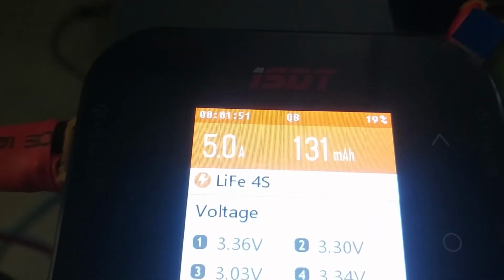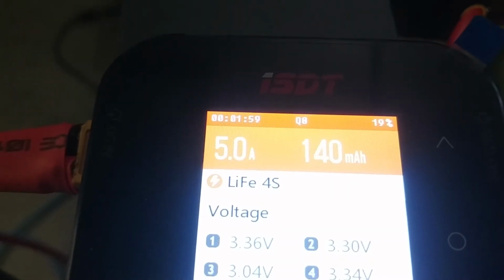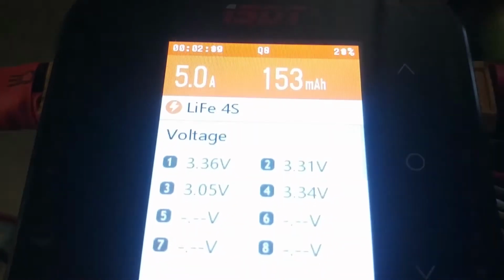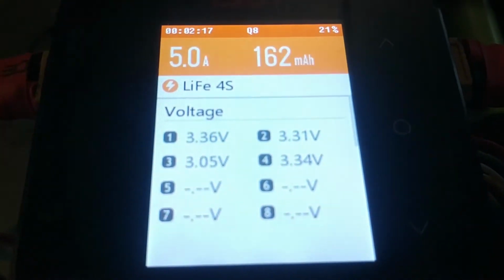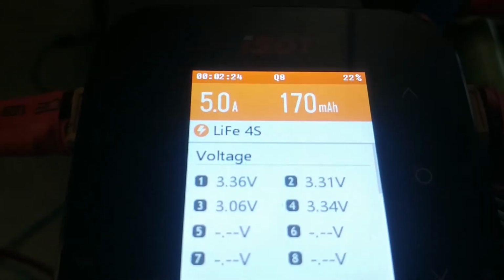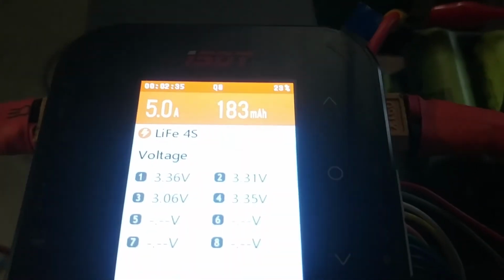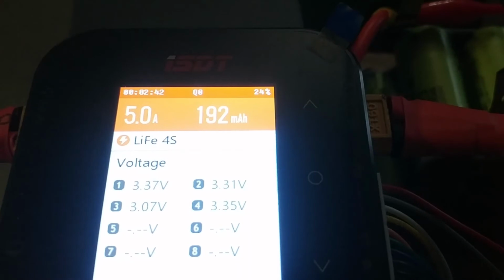Anyway, 80%, what's 80% of 17? I have to figure that out. About 14 and a half or something. Anyway, I picked a pack that wasn't very good to try this on just for that purpose, to see how bad they really get. So this is down at about 60% with a bad set of cells, at the number 3 cells. There's at least one with a puffy end on it. So anyway, interesting. Waste of time, actually, but that's why I never do capacity tests. It takes forever. I was 2 days doing this, trying to get it down. Anyway, we'll see how she charges up.